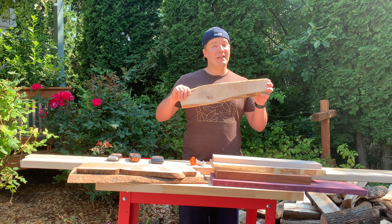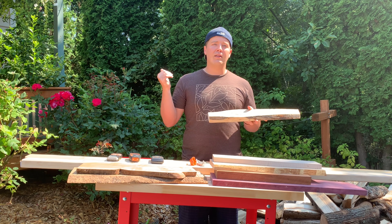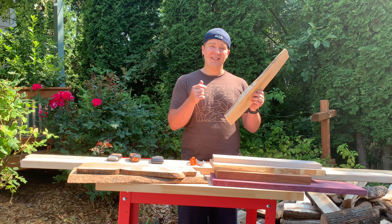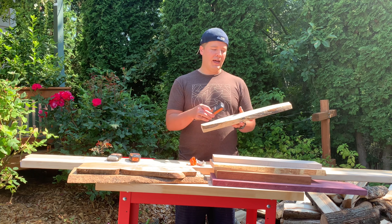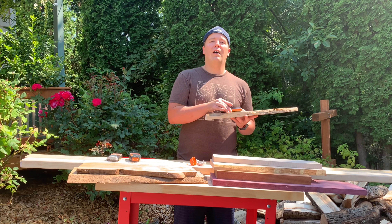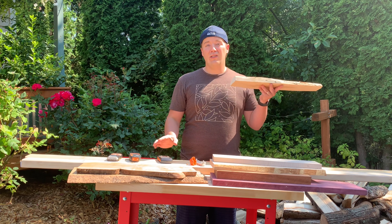Another application: I did some milling of small maple pieces. I let them air dry outside, stickered, playing urban miller. Some pieces were inside — one got pretty dry and the reading stopped changing. Going outside to check the others, those are still at around 16%, while the inside one is hanging around 11%, so I know I have a little ways to go.